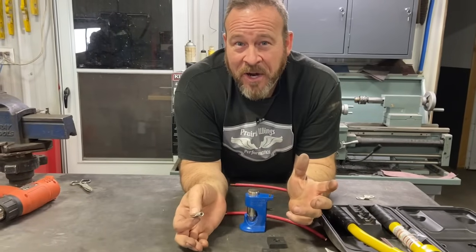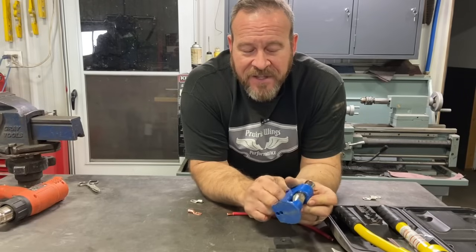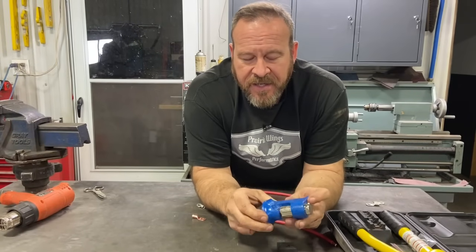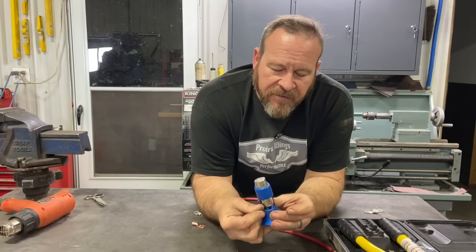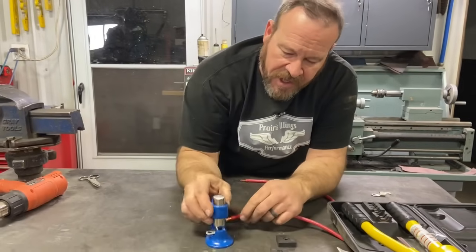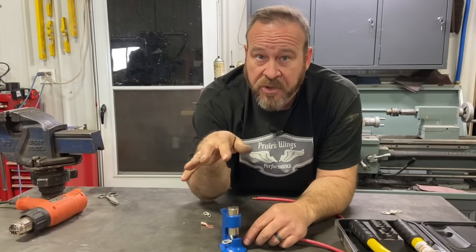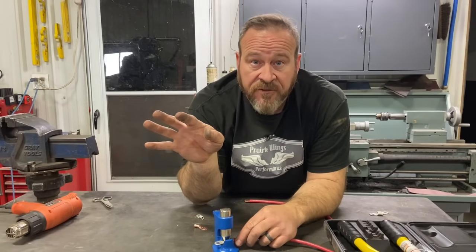I'm going to talk about another method that I switched to a lot of years ago, which was actually taught in the dealer courses. This is something I would keep on my welding truck because it's small and compact and doesn't add a whole bunch of weight. It's a crimper that you put the end in, put your cable into the end of it, get it set in there properly, and then you nail it with a hammer. It does a really nice crimp — it actually works really well. Then of course you'd heat shrink it. I used it for years and years.